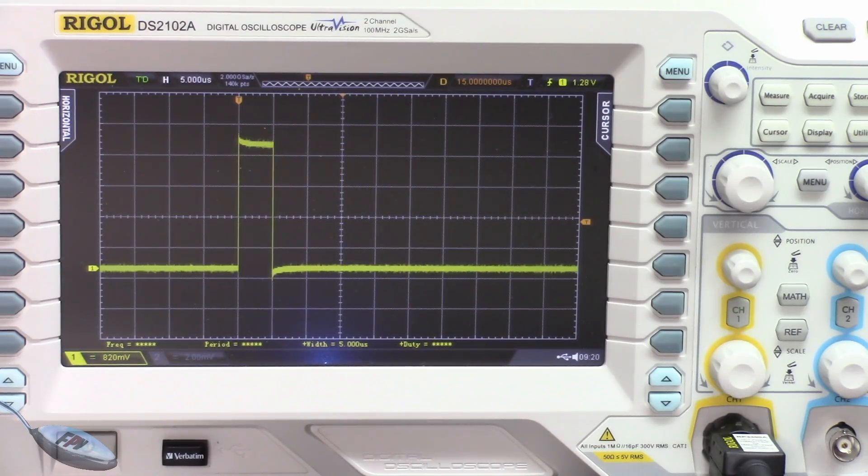So this is MultiShot. It is the narrowest pulse width of all of the analog signals we have. The minimum width is five microseconds, which is at zero throttle - where most people aren't flying. When you get up to about 1300 on the motor request, which motors are generally over, you're starting to get into the DShot 1200 speed range and the ProShot speed range.